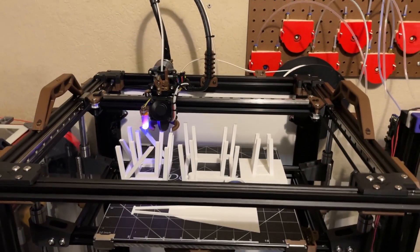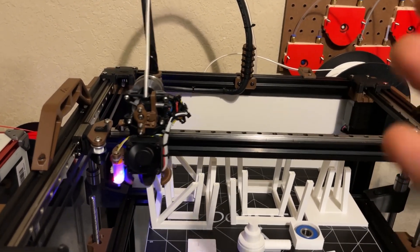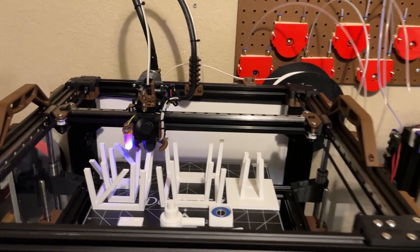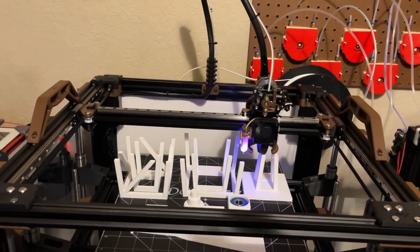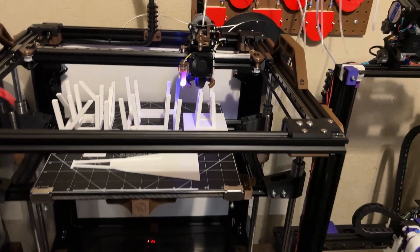That's what I love about this setup. I know canbus PCB boards are the new thing, but when that gets popular I'll transition then. For right now I'm going to stick to the Igus continuous flex cable and JST and Micro-Fit connectors.